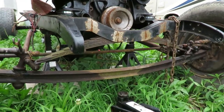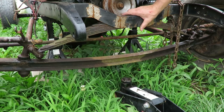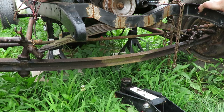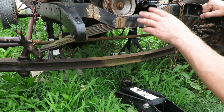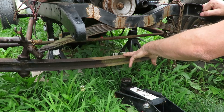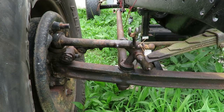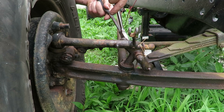After getting that one arm off, I'm going to go ahead and get the entire front end out from underneath here. I'll have to lift it quite a bit — I'm going to have to get the engine hoist and lift it, then set it back down on jack stands, because there's no way I can lift that up by hand with the engine on there. I want to get small parts off and try to get whatever I can sandblasted and then painted. I'd like to get the i-beam wire-wheeled and painted up, and get the hub areas all cleaned up too.